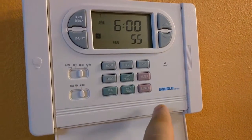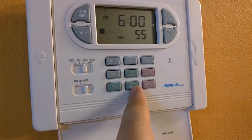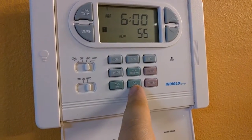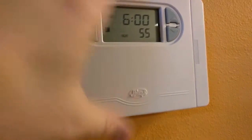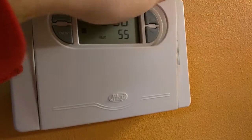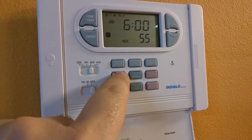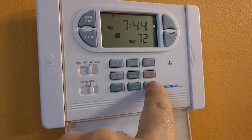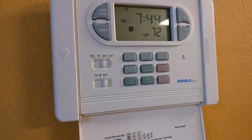That's all you need to do. There's a hold/clear button in case somebody holds the temperature — nobody should push this button. Whenever somebody wants to set it up, once it's fully been programmed, it's very important that every time you finish a program — say for Monday, Tuesday, Wednesday, Friday — you always hit return. That saves it and pushes it into the memory of the system.